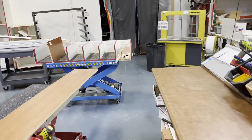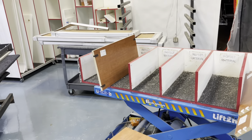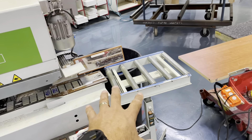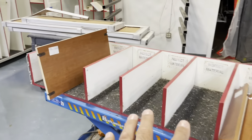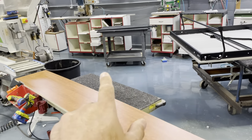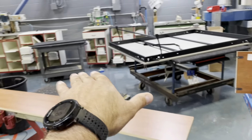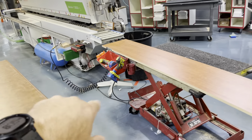Carts are an issue in this area. We've got this sort cart where we put our shelves when they come off the edge bander before we bundle them, but it's positioned far out, so when you're working at the edge bander you've got a long walk. One of the things we talked about today is making a modification — we're going to weld on some brackets that come up and out, then move the sort tray on top of that. As pieces come out, long items will go right there so you can sort without leaving the area.